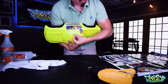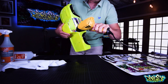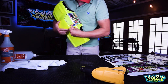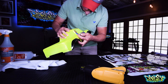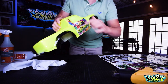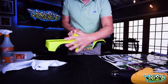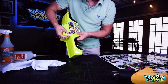This has dried up here so I'm just going to push it down with my thumb because it's such a small piece. A little bit more heat. I'm going to do a check for any air pockets or air bubbles — I don't see any. Just a little more heat here. This is a tough spot because there's a groove. You want to give the water an ability to get out using gravity. Because the groove is right here, if you turn it and use your finger, gravity will help push that water down that channel.